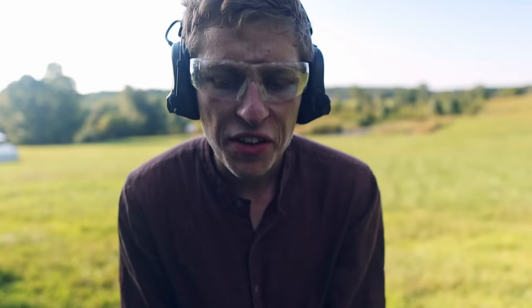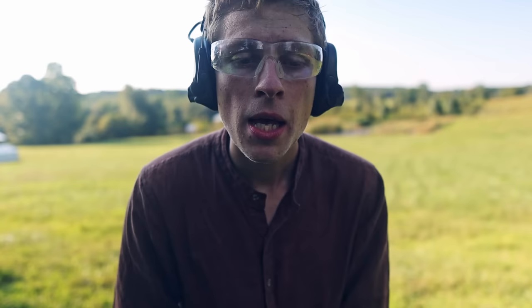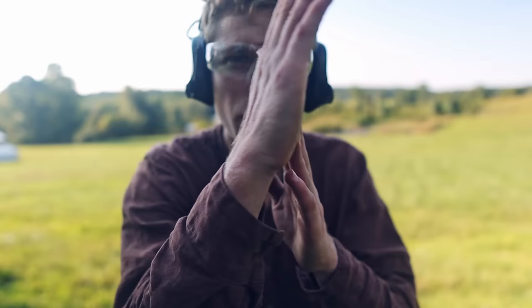Interesting. I just reviewed the footage from the GoPro at 240 frames per second as best I can on a small screen, and the conclusion that I come to is that the cheaper bolt carrier group, for whatever reason, I think it has a weak ejector on it. I felt it with a punch and it felt much weaker than the Aero Precision one, like the spring is too light or something's damaged. For some reason, the brass is not tilting as much as it should. It's not getting flung out as much, so when it hits the brass deflector, rather than kind of tumbling out of the gun, it's being pushed forward.